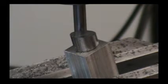For the slot, I'll pick up the back of my fixture. I know where my hole is — it's in the center of the fixture. Once I've picked up, I'll move to the center of the fixture, which will be the center line of the cutter. I've switched to a 3/16 four-flute end mill at 350 rpm and I milled the slot in about 200 thousandths deep, then finished the sides of the slot. I'm going to use a 3/16 high speed steel blank for a cutter, so I wanted to give it about 10 thousandths clearance — 5 thousandths each way — and it worked out perfect.